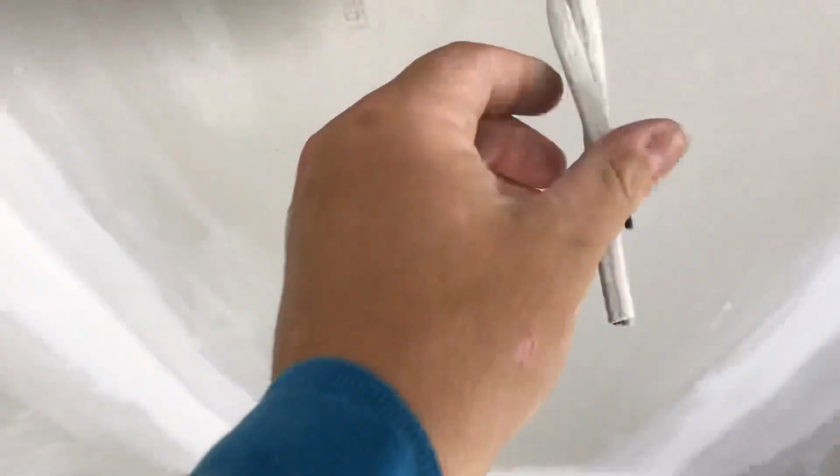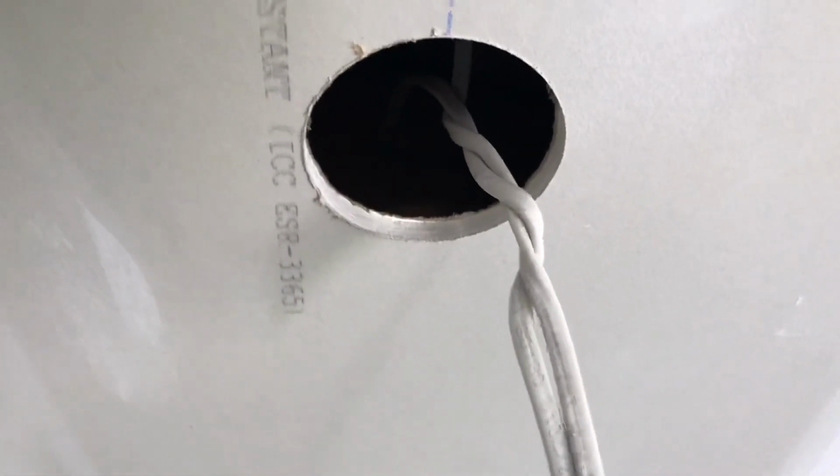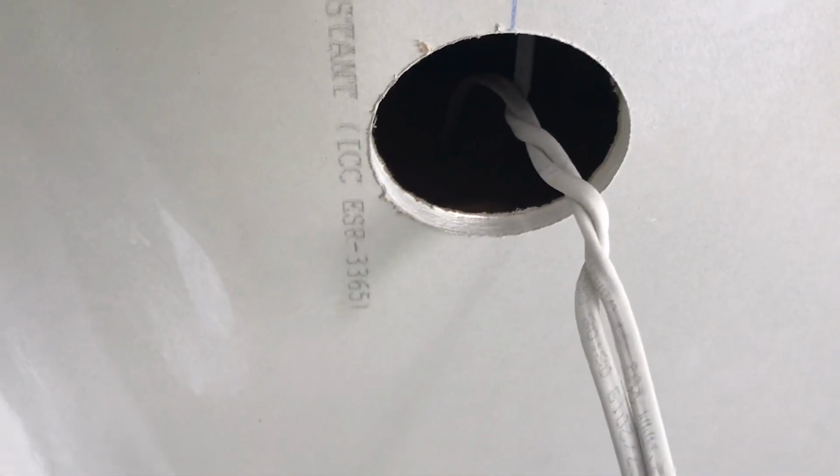All right, we got two wires. One is the main, obviously, coming in. The other one is the tail that's going to shoot to the other three lights. So we're going to continue. I'm going to go to each marking, like I told you, drill my holes, and then we're going to open up these wires. We're going to splice them, and we're going to get into those new lights and see how they hook up. Remember, reverse, you'll get right through it, go easy. And make sure your chuck is tight.